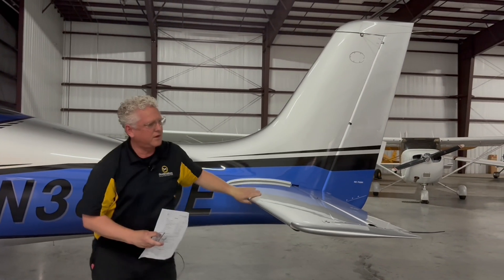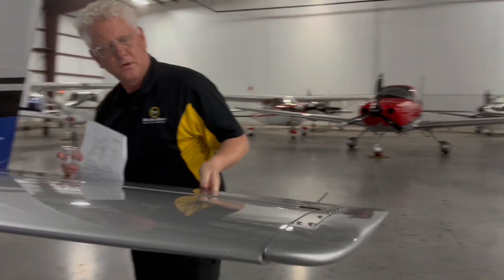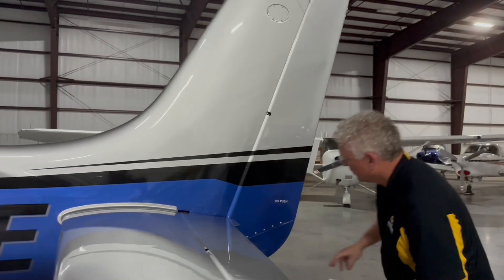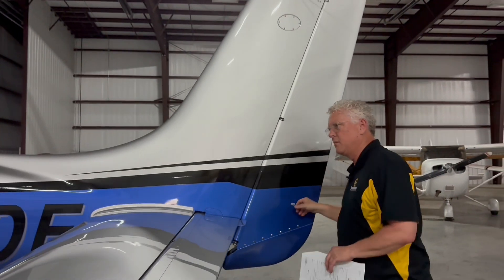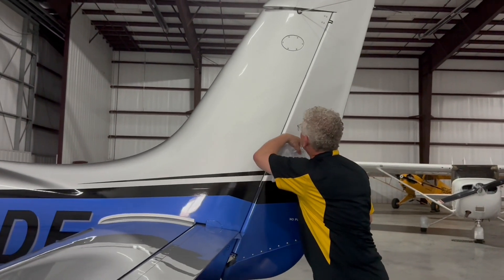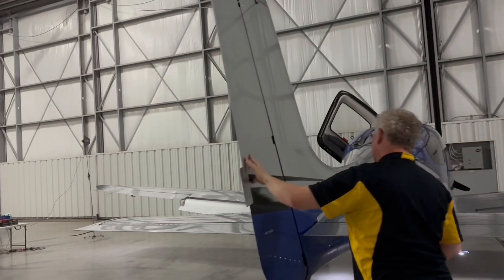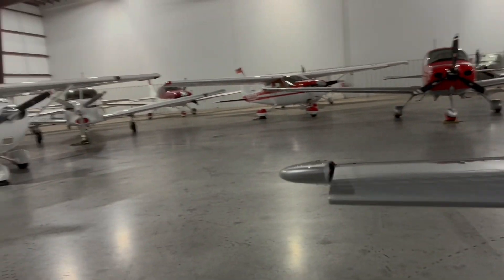Static wicks, free motion. In here, we've got this weight — just need to make sure that weight is there and it's spring-loaded back to center. On the rudder, we're looking at these cotter pins. It says no push, but that means just don't move the airplane. We can move it side to side a little bit and it's spring-loaded back to center. Cotter pin looks good, cotter pin looks good. Same on the elevator on this side — spring-loaded. Real hard to see the attach points because they're kind of buried internally, but we can see that counterweight is in place.